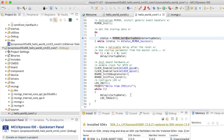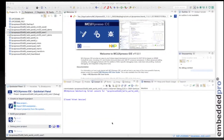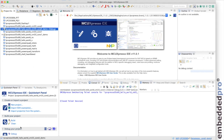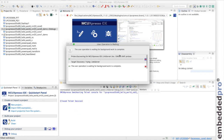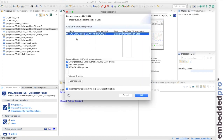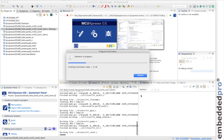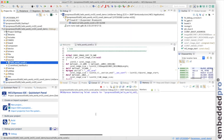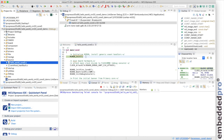Let's compile, download the code, and look at it in the debugger. I select the core 0 project and run the debugger. MCU Expresso IDE performs probe discovery and finds the LPC-Link 2 on the LPC55S69 EVK. After rebuilding, the MCU Expresso debugger finds two cores available on the Serial Wire debug link — core 0 and core 1. Since the project is built for core 0, we connect to core 0. Flash memory is programmed and the debugger runs up to main in the core 0 project.